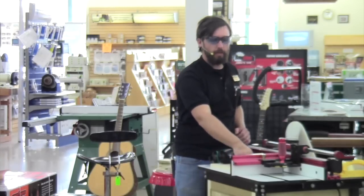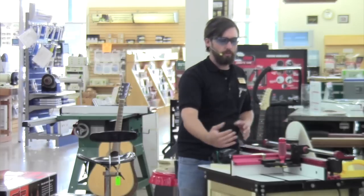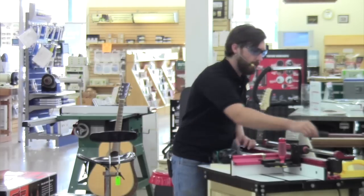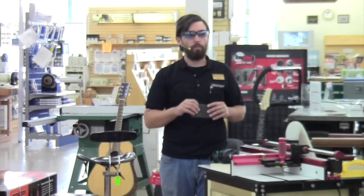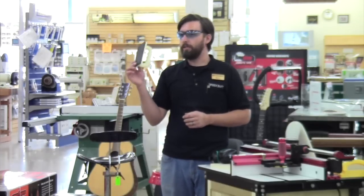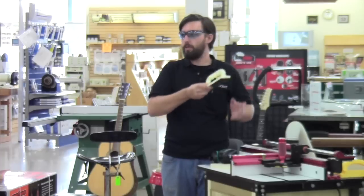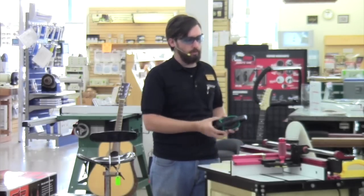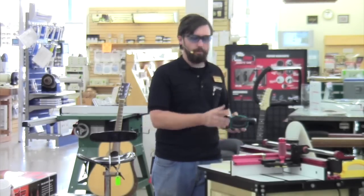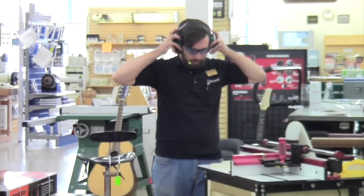If you are using a regular miter gauge in your miter slot, you'll probably have to put an auxiliary fence on there for extra backing. There's one push block that I don't normally use, but I'm actually going to use one to help hold the stock down as I'm pushing it through so it doesn't jump around. Unfortunately, you can't use a feather board with this — the miter gauge gets in the way, so no feather board at this point.